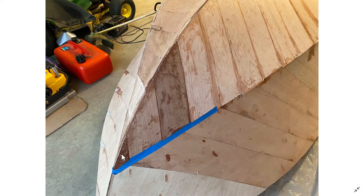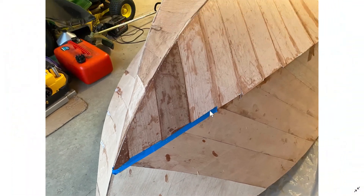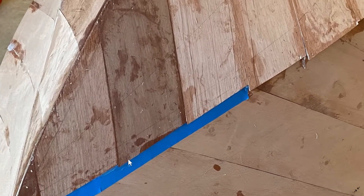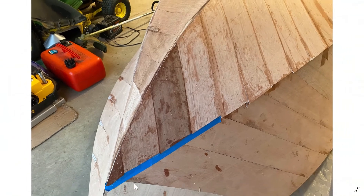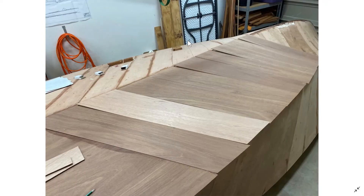Here I'm working my way towards the front. You can see all the composite nails I've put in place. I put a strip of tape here to help with a little overlap area, which makes it easier. I can then trim those off with my Dremel tool and a cutting wheel. I also started using my table saw to cut angles on the boards — they're not all just squared off — trying to cut close to the angles needed to make future trimming easier.